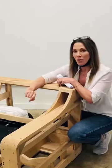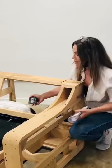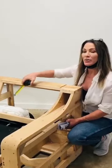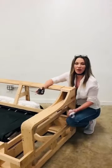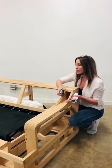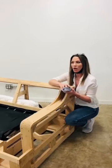Once you add your seat depth of about 22 inches, you can be in the 34 to 36 inch range for overall depth. So for a tight back with the Cozy mattress: 9-inch clearance, 1-inch frame at back, 1-inch at front, add your springs and minimum 2 inches of foam — that's about 14 to 15 inches — plus the 22-inch seat depth puts you at right around 36 inches overall, probably nothing less. We can do a little less foam or use webbing, but the back won't be as comfortable. For the most comfortable sofa, aim for that 36-inch depth for a tight back.